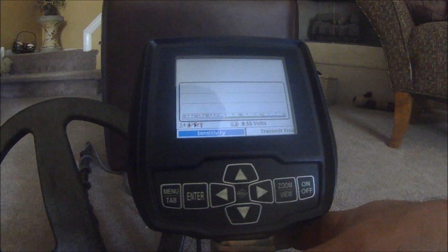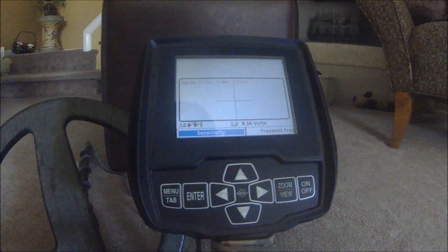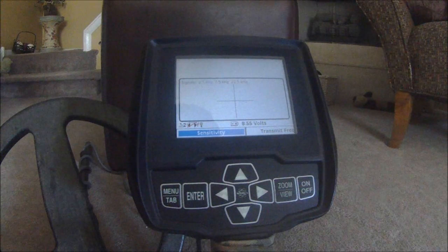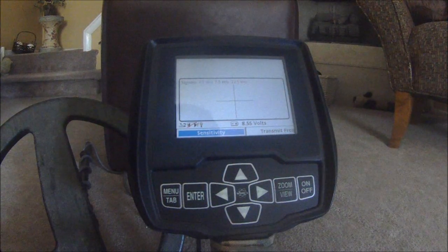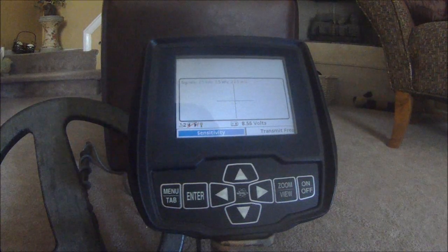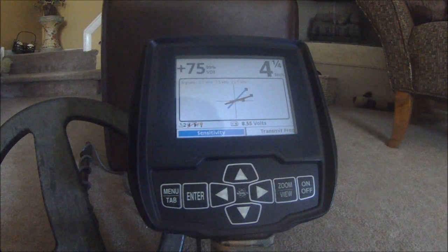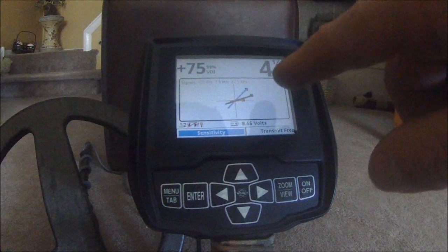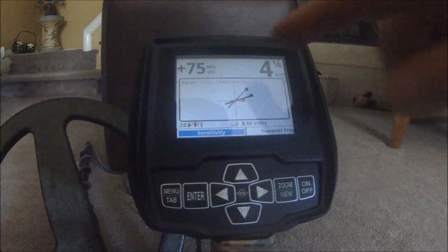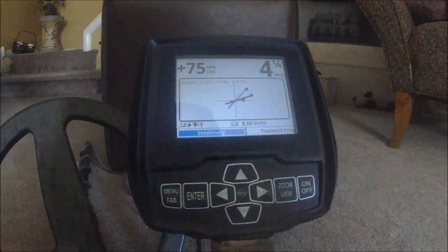However, if you take the same trigger and click it forward, locking it into a position, you kick into a different screen — that is your Polar Plot screen. Your X there is your VDI range, with the center of the X being a zero point. To the right are your positive VDI numbers; to the left are your negative VDI numbers. With that silver dime, let's wave it across the coil — we have a nice, clean set of arrows, all three frequencies giving a clean indication of our target. We have a plus 75 VDI number, and the machine is 99% confident that number is correct at 4.5 inches in the ground.